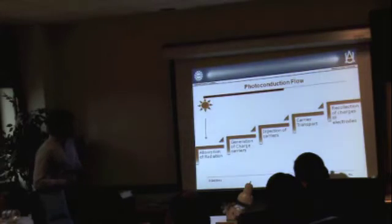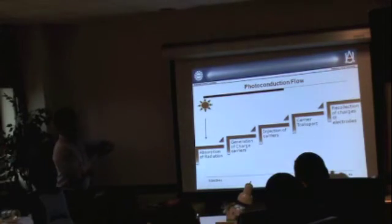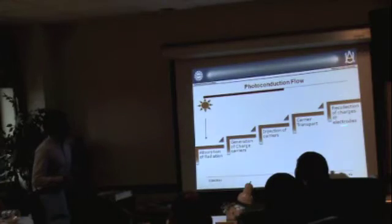It tries to break that, dissociate those pairs, and then inject those carriers so that they have enough power to move to the electrodes. Now we have N-type and P-type in the middle, and all the metal electrodes on top and the bottom. So we're trying to give enough energy to those carriers, or the charges, to transport to the electrodes so that we can capture them and generate electricity, with carrier transport and the collection of charges. That's our model.